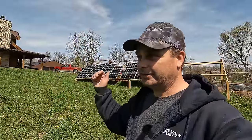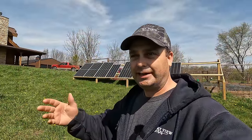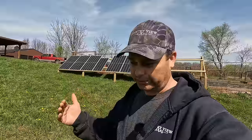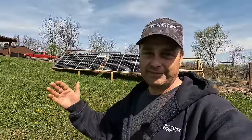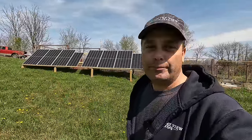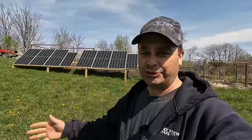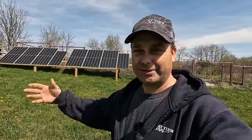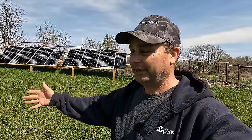My final thoughts on the Delta Pros: I think the only time you'd ever need two of them is if you really need the 7,200 watts of power or if you have a 240-volt load you really want to power — but more than likely that'll drain your battery very quickly. So if you don't need that 7,000 watts, your best bet is to just buy a single unit. You could buy an extra battery, have the same amount of storage, and actually spend less than buying two units.